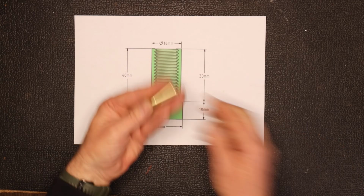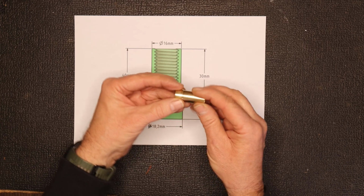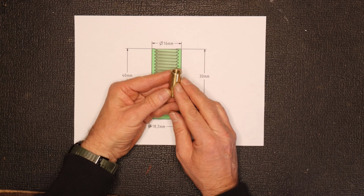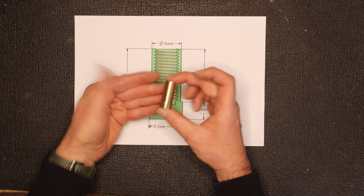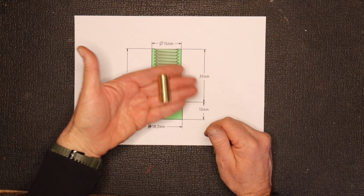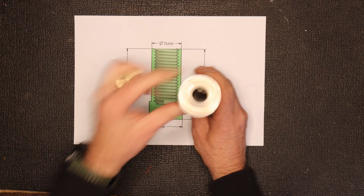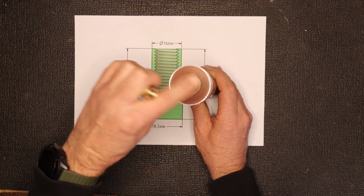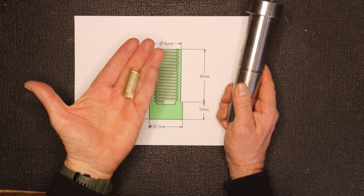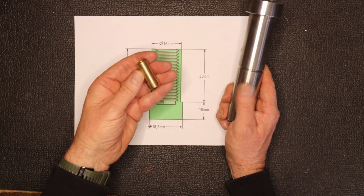Okay, so this is the end result over here. I think it came out pretty well. I think the advantage of making a separate tip of the plunger, the whole shaft and everything, is that should I at any point wish to increase the size here or bore this all the way down to the bottom, I just have to remake this part and not the connector that goes between here and the actual pneumatic press itself.